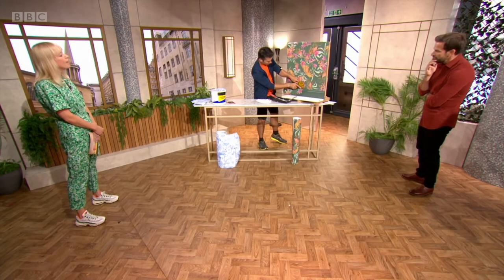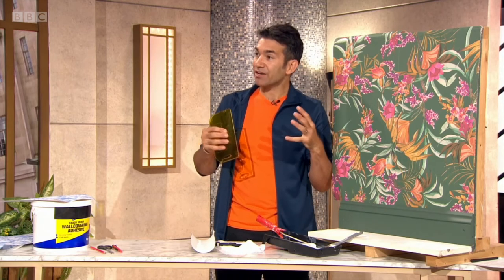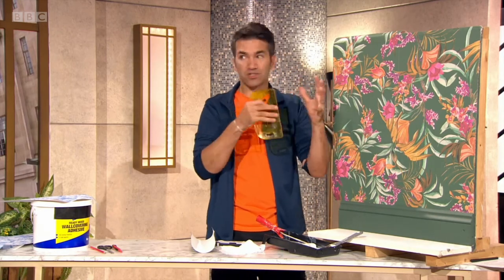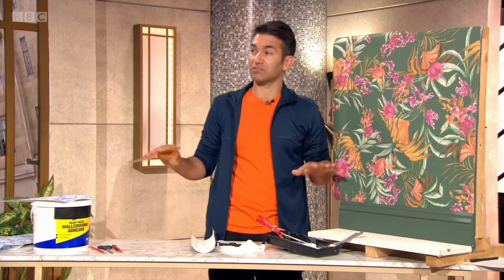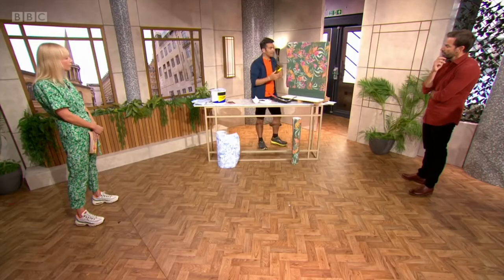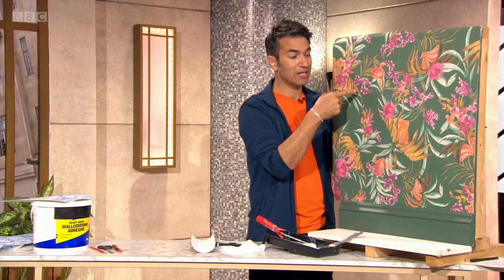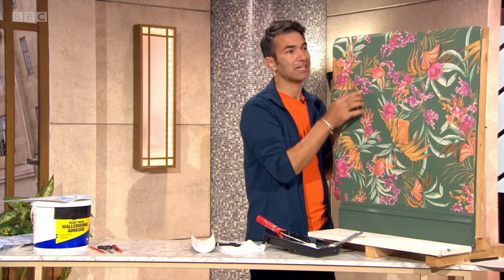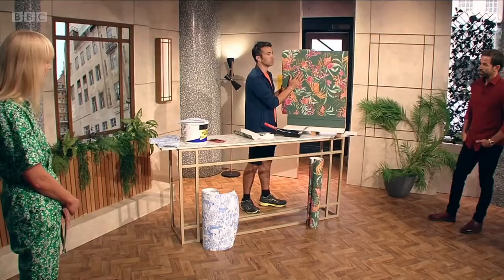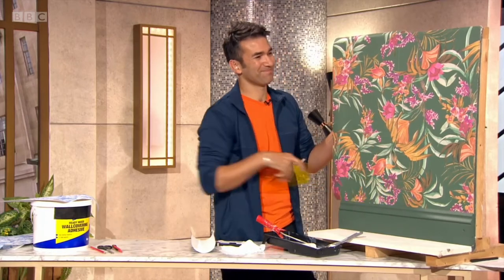So what's the best way to get out any bubbles? If there are any bubbles, leave it a day — let it dry first, because the wallpaper swells and contracts. When it's dried out it'll contract down, and normally the bubbles will disappear. So don't worry to start with. If there are any major bubbles, you can put a pinprick in it, or if you've got a little syringe, you can inject some solution in if there's a dry patch underneath. Wayne doesn't need any of that — there are no bubbles on his, it's perfect.